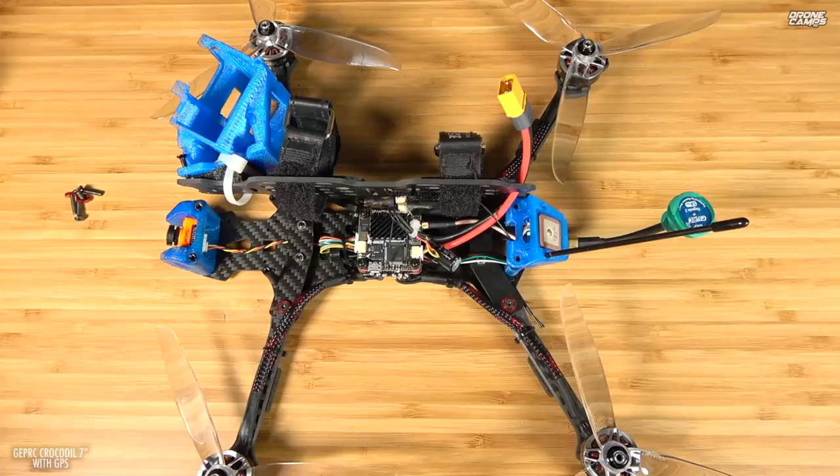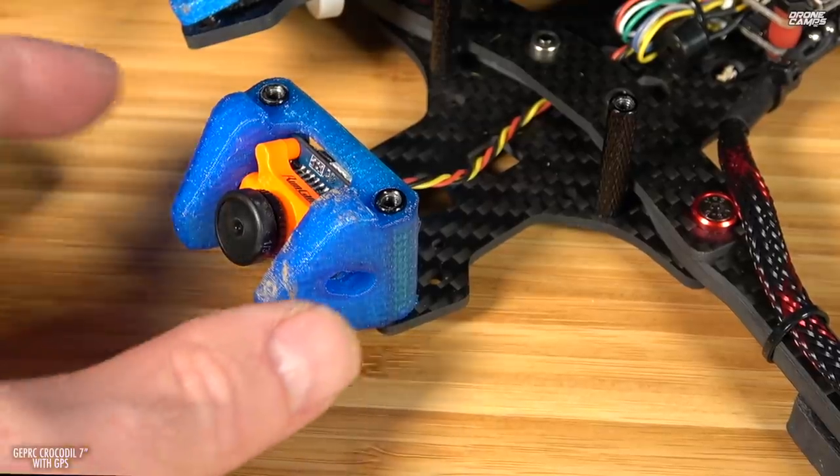You can also see printed on that board it says Omnibus F4SD — that's the firmware on here. So when you use this boot button, you're going to hold that gold button down and reflash this with Omnibus F4SD, the current firmware version which I believe would be around February 2019. Very simple layout. I think they did a great job at keeping this quad as simple as possible, especially if you're getting into new territory like GPS. You want something that is going to be nice and easy to work on if you have to repair things.